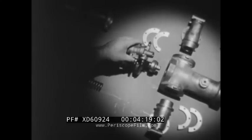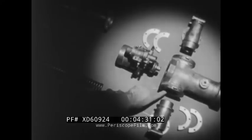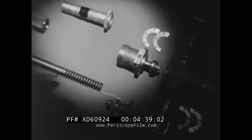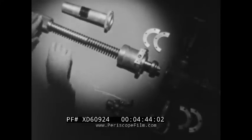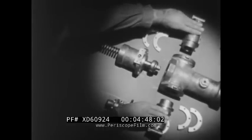When gun actuating air passes through the main control valve, it moves the main fuel valve to the rear. This lets the fuel flow into the gun nozzle for firing. When the pressure is cut off, the main spring reseats the valve. These elbows act as trunnions for the gun during elevation or depression.